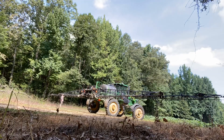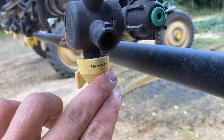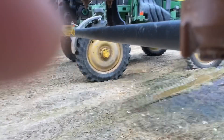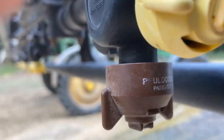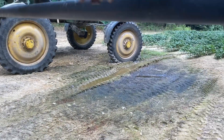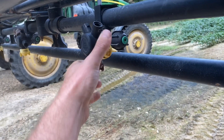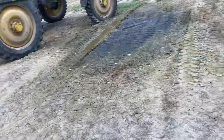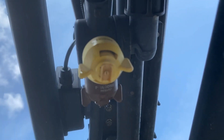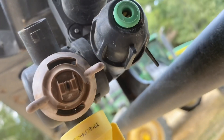Now I've got to spread the boom out and put the yellow tips down. The reason I'm changing these tips — as you can tell, these are 8002s. The brown ones are a 2-0-0... I believe that's a 5. Definitely a 5. So tighten that back up, flip that back down. The little hole at the bottom is so much smaller on the yellow tip versus the brown one.